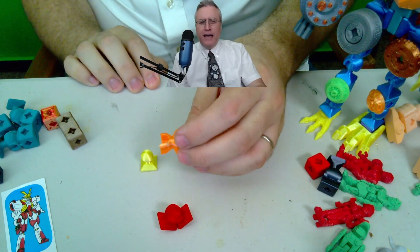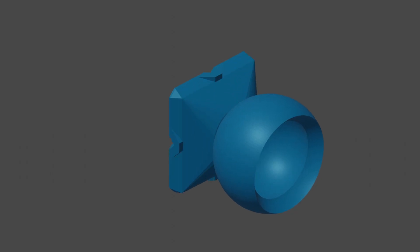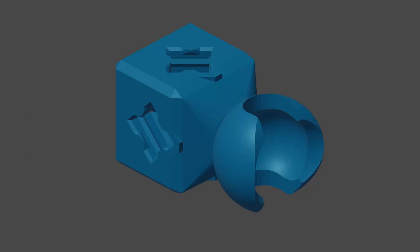So I've had it in my mind for a while that if I could redesign this piece to print laying down, so the layer lines go horizontally, the flex would work with the layer lines instead of against them. It took me a while to actually try implementing this, but I finally did. I started by creating a ball and joint set from scratch, but I couldn't make the socket any bigger than 16 millimeters or it would stick out the sides of a normal printer block. I want everything to fit inside that space neatly. When the top and bottom gets cut off for the sockets, it doesn't touch the build plate, so I extended it out with fins that reach from the edge of that cut to make it touch the build plate. After testing this out, it actually worked really well.